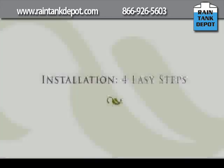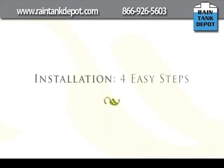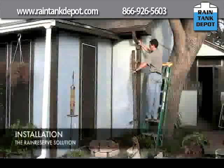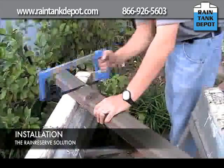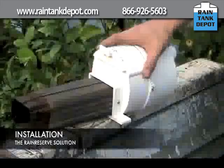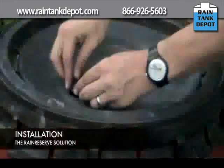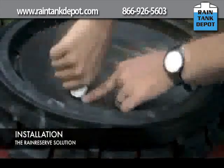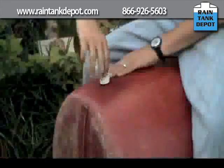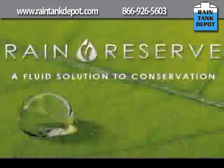You can install the Rain Reserve Diverter into your existing gutter system in four easy steps. First, modify the gutter downspout to insert the diverter system. Attach the Rain Reserve Diverter to your downspout. Modify your storage tank with the tools provided and connect the diverter. Use the kit spigot to produce high flow pressure to a hose, bucket, or watering can.